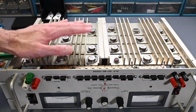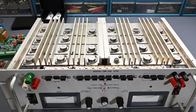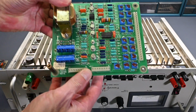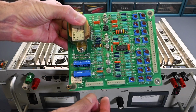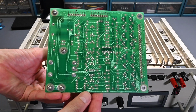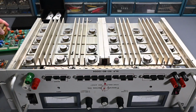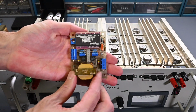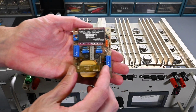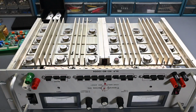So of all the transistors, there was actually only the one that was bad. And I replaced all the electrolytic capacitors, so there weren't that many, but this board right here, these two in the power supply section. So the board's looking very good, no problems there. And on the little isolation amplifier circuit board right here, there are 4 electrolytics. So that's all been taken care of. So I'll go ahead and continue with the reassembly, and when it's all back together, we'll be able to test it.